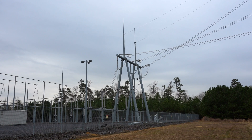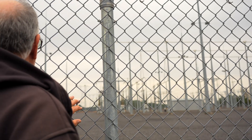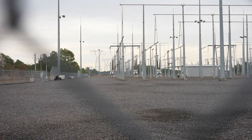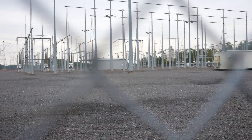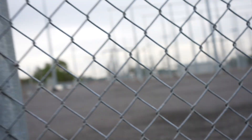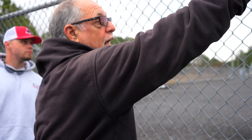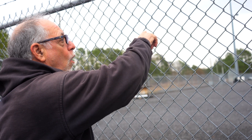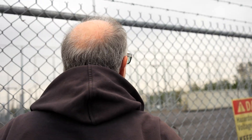So you've got 500,000 volts. It goes to this structure over here. All this is a switch yard — it's not a power plant. It doesn't step voltage up or down. It's a switch yard. When it comes in and hits that structure, all that tubing that you see up top — there's three different rows — it's all energized. So if you go in there and think you're going to climb up and do pull-ups, you have a bad day. That rack structure is all energized.